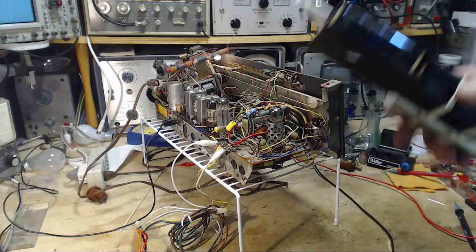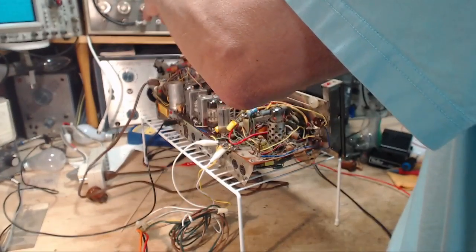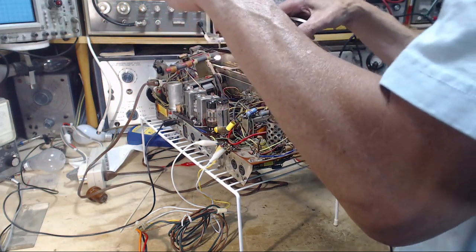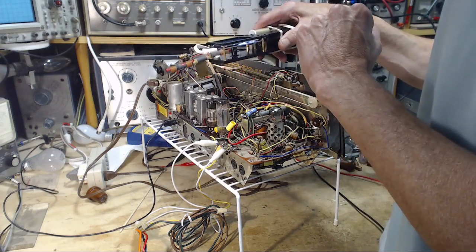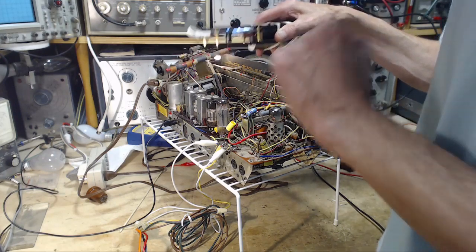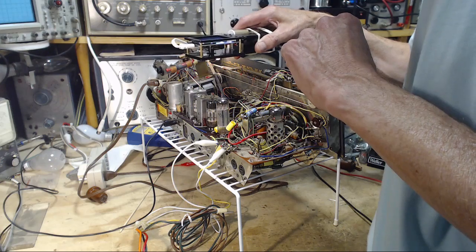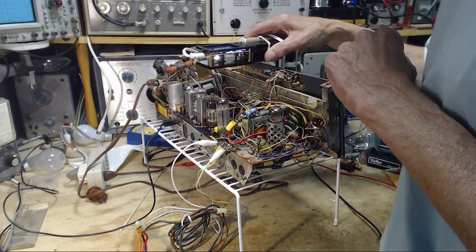And while we're here, I'm just going to scan quickly down here and just see if there's... So I'm learning every time I use this how to get more and more benefit out of it. Yeah, so see, that resistor down there, I can measure its temperature here, right there, about 40, 45 maybe, that's not so bad. Let's see, the temperature difference between this tube and this tube is really, really apparent.